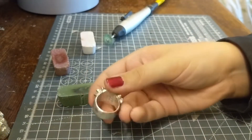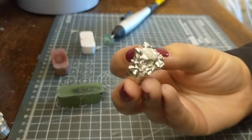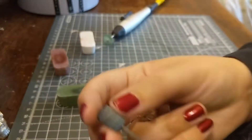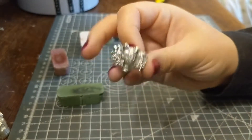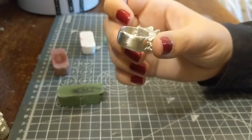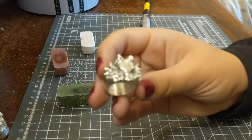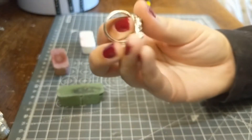So we have smoothed off where the sprue had been attached and then ground away — that's where the sprue was, which fed the metal in. I've also given it a once-over polish so that it's looking pretty much how I want it. It's looking very shiny. I was using a combination of rubberized abrasives in different grits, then some polish. When I used the polish I saw a few more places I wanted to refine, so I washed it, went back, ground it down again, and then I used the radial bristle brushes — these also come in different grits, and this is a fairly fine one, so that's why it's looking nice and shiny. The inside is still looking kind of messy, but much smoother and it feels much nicer now — it's more wearable feeling.